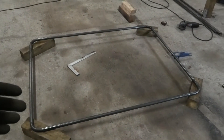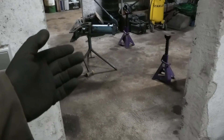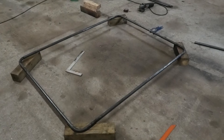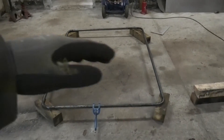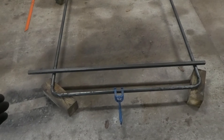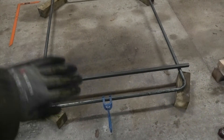So that is the base of the rack done. I'm actually really surprised that it lined up as well as it did in the end. I was going to make this in just two halves and then weld them together, because this old manual tube bender that I have is just not meant for this kind of precision work — there's just too much slop in everything and there's no way to line things up. But the first two bends went really well so I figured I'd just keep going, and everything just went really well this time, so now I'll only have one weld in the end and that's all the better. Now I have to do all the cross sections and I'm going to be making those out of what I think is one-inch square tubing. I should have enough of that to make six pieces along there and that should be plenty good. Some of you might think it's because I don't have any more round tube — and that's correct — but I honestly think it's going to work out really well, because that will give things a nice flat surface to sit on instead of all those curvatures of the pipes.